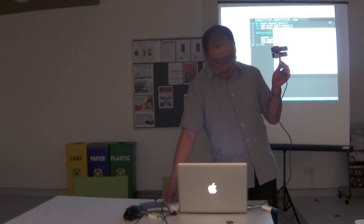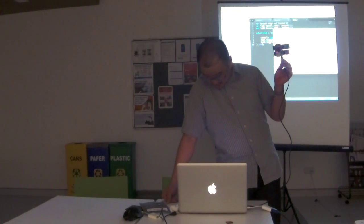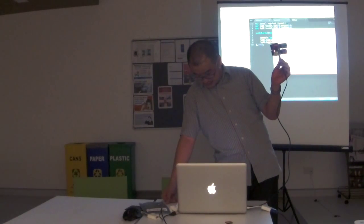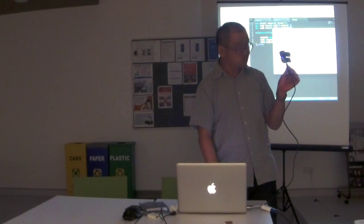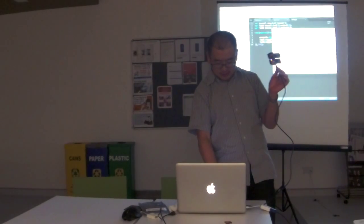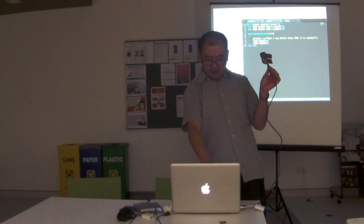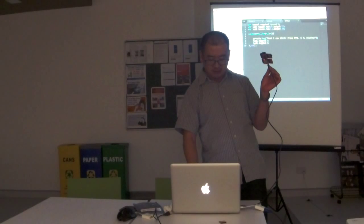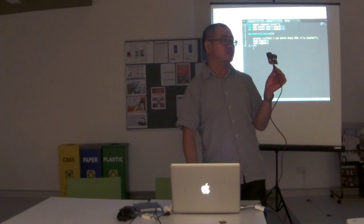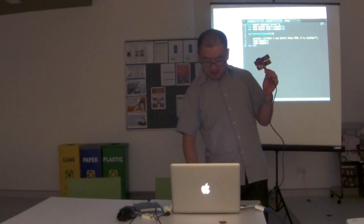All right, it's compiling. Does it work? All right. That's it, it's blinking. And it's logging now. Right, simple as that. Two LEDs, and you can set the interval. I mean, it's very simple and basic, right? No rocket science. It just console logs a message while it blinks. Control C to stop, and the LED toggles on and off at 100 millisecond interval. So you can set 500 whenever. Sorry, this is only on the board.